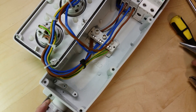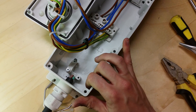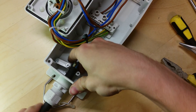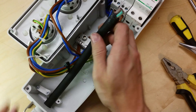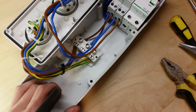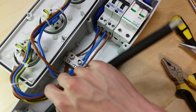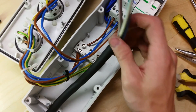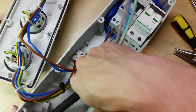I need to do the gland, do the cable grip, and then wire the connector onto the other end. I'm going to post this cable in — hopefully this gland is an appropriate size for this bigger cable, though it's probably going to be tight. I'm going to loosen it some more and try again. That's much easier — get it up and over the grip. This cable is considerably bigger than the one that came out, and the rubber sheath is larger as well, which makes it a bit harder to work with. There's plenty of length, so I'm going to trim the sheath back and pull a bit more through before trimming.